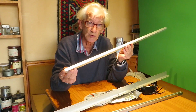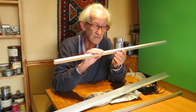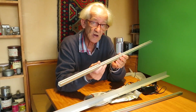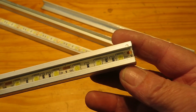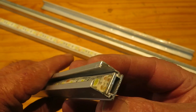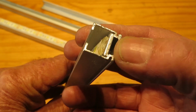Now that we know which LED strips are appropriate for our chargers, let's see how we assemble our LED lamp. The first thing we need is a support for the strip. An aluminum support lets us fix the strip to the wall, change the angles, and is very useful as a heat sink to absorb heat from the diodes. An old aluminum track for a sliding curtain is a very good option, although any aluminum form will work. Option one: at the bottom of the track. If we stick the strip at the bottom of the track, we need to fill that space with aluminum or silicone to ensure good adhesion.